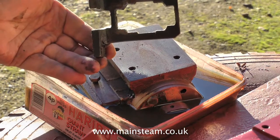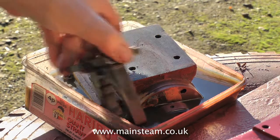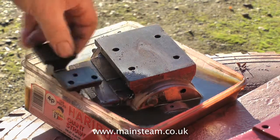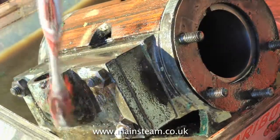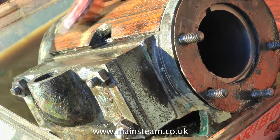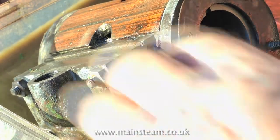This is the motion bracket which supports the crosshead. It's not painted, it's just greasy, so I'll put it in the cellulose thinners just to de-grease it ready for painting. In the short time while I've been reprofiling the stanchions that support the main bearings, the cellulose thinners has done its stuff — most of the paint's fallen off the cylinder. It just needs a bit of help now with the toothbrush to get into the stubborn bits.